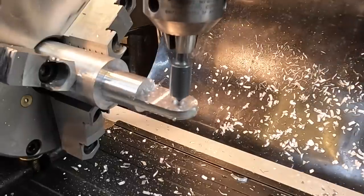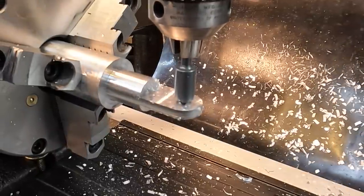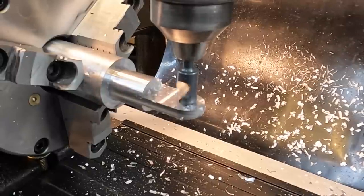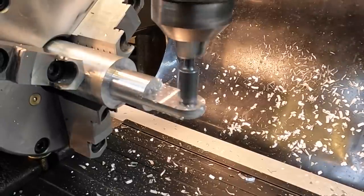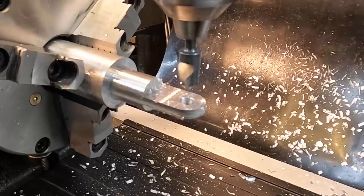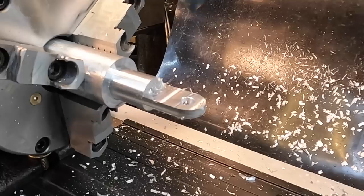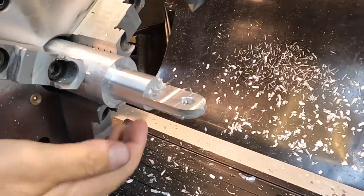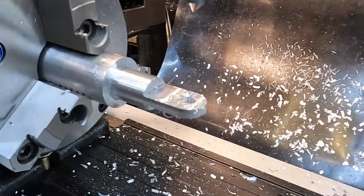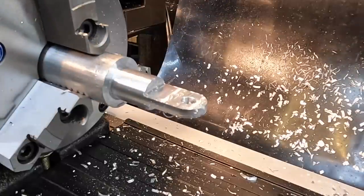What I'm gonna do is I got this set up on a stop there, so I'm all the way down on the stop. I'm gonna use the hand crank on the knee to come up, touch it just like that. That looks pretty good, but I'm gonna come up a few more thou. That looks good right there. All right, we'll take and rotate it back around here to our zero. Come down and bump our stop. And that should match it nicely right there.